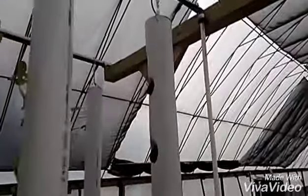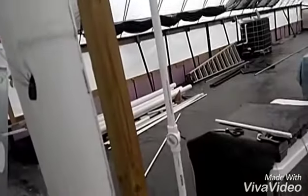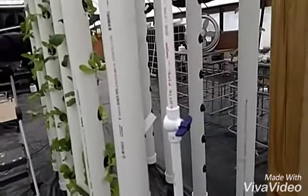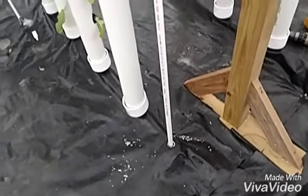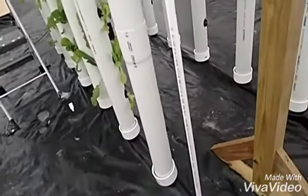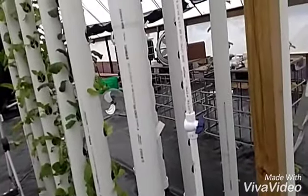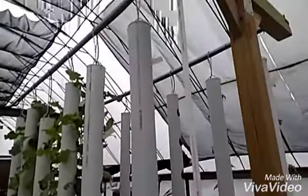I'm going to add this half-inch PVC line here on the end — you can see where it comes here. It's going to come down there and run down. I've got a shutoff on it here so I can open it wide open, turn the pressure up, and let it blow out. That's just going back down to the feed line, so that'll just circulate. I'm probably just going to leave that cracked open just a little bit so the water just keeps going down through there.